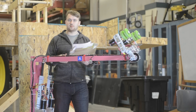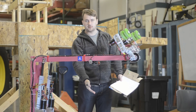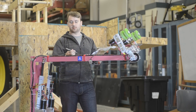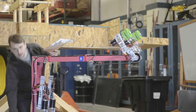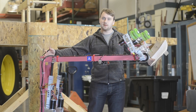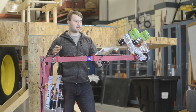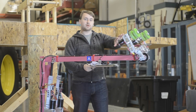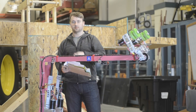One of the main features of our robot is this arm mechanism that can raise up to about seven feet or lower all the way down to the ground to pick up the power cubes. This axle is about 46 and a half inches off the ground. Our arm end to end is about 48 inches. As far as creating a moment arm, you can imagine there's quite a bit of torque out here, where there's about 20 pounds of mechanism at the end, accounting for the arms as well.